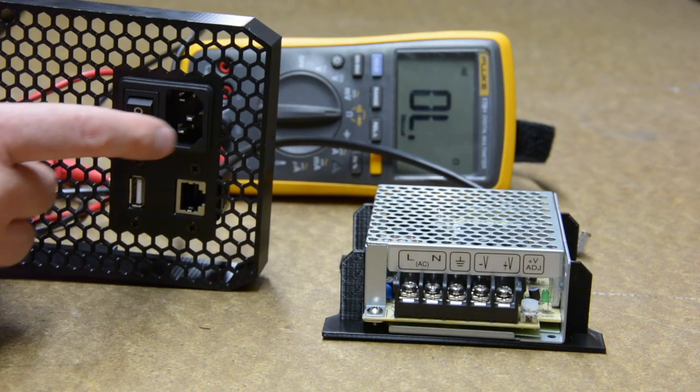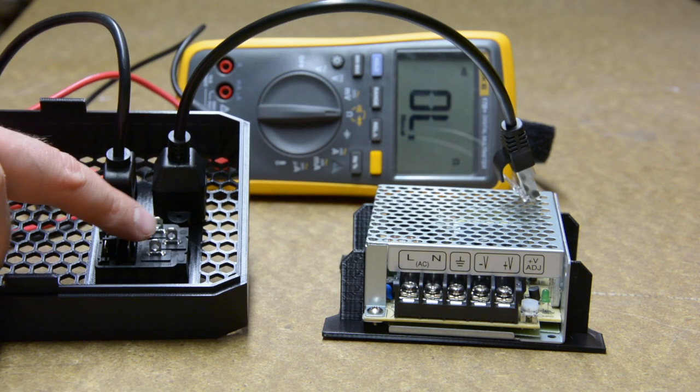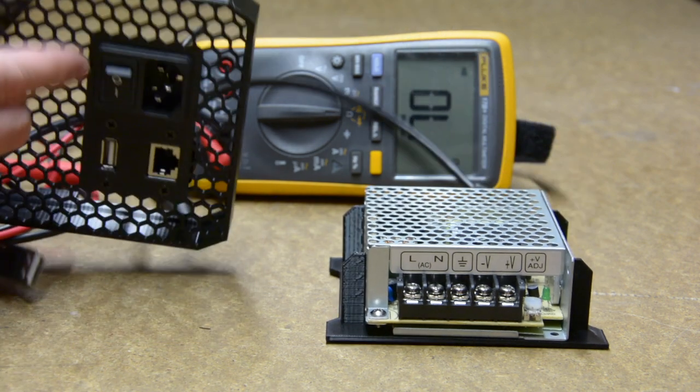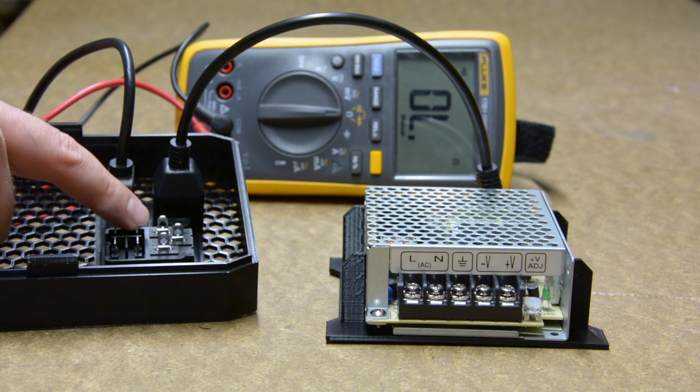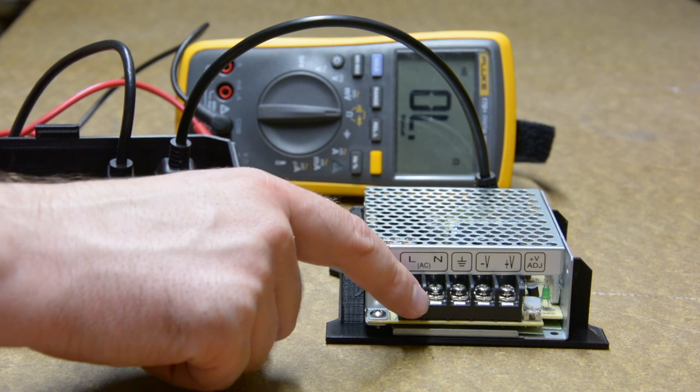The next step is the cabling of the IEC connector and power supply. The top three leads are directly connected to the power cable. The two rows of the bottom leads are for the switch. In some connectors, the wiring between the connector leads and the switch is already done by the manufacturer. In this cheap one, I need to connect it by myself.